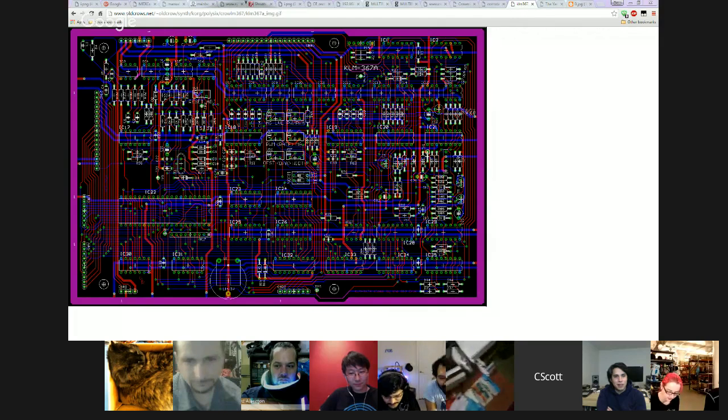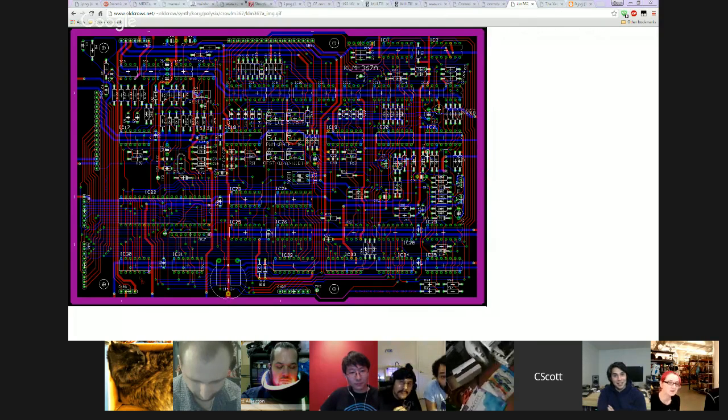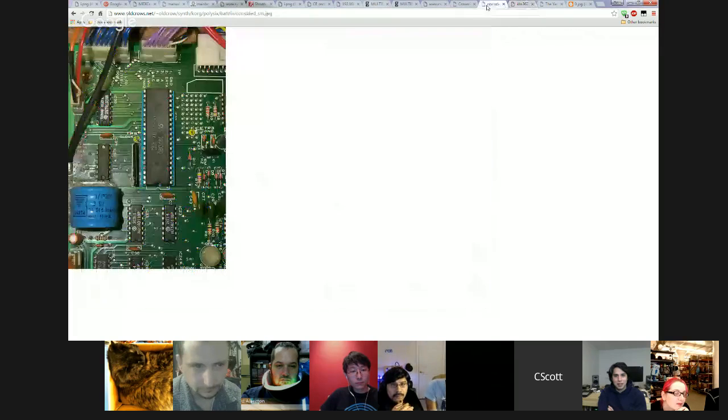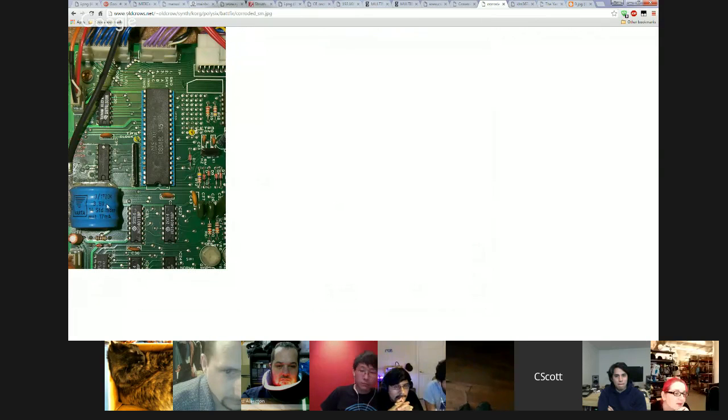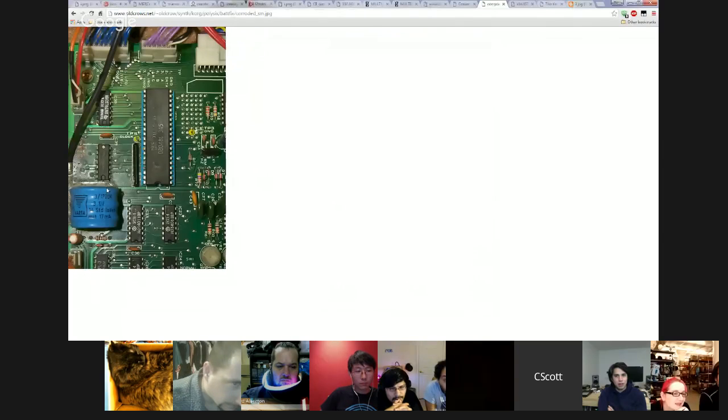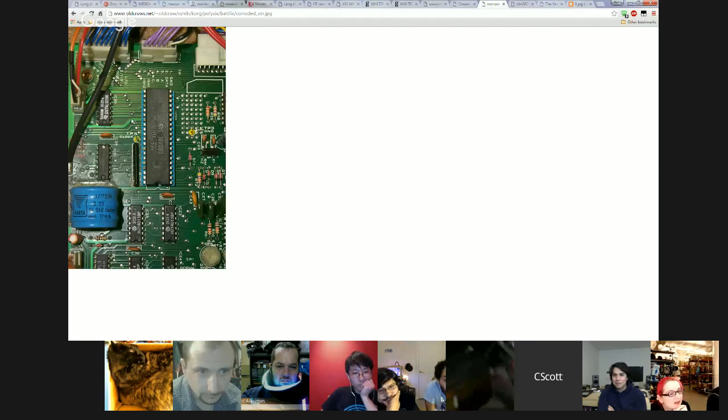This is the very first board I ever did in Eagle. I did this in the fall of 2001. This is what I call a patch manager board. It was for the Korg Poly6 synthesizer, which had this particular problem. It had a NiCad battery on it, and it was installed in an area where these are all data bus lines and stuff off this microcontroller, and after enough years, it'll start to outgas. You can see the fuzz here, and this is corrosive. It starts getting under the photoresist. It'll enter through the places where the solder mask is bare, and pretty much ruin your circuit board.